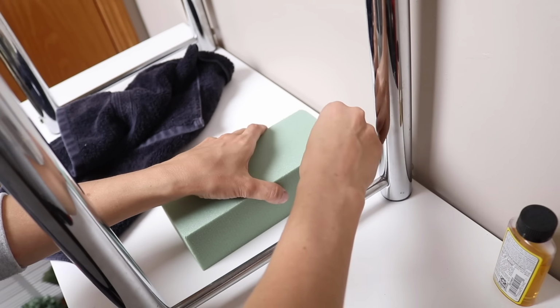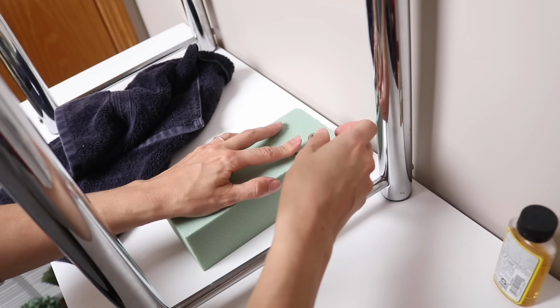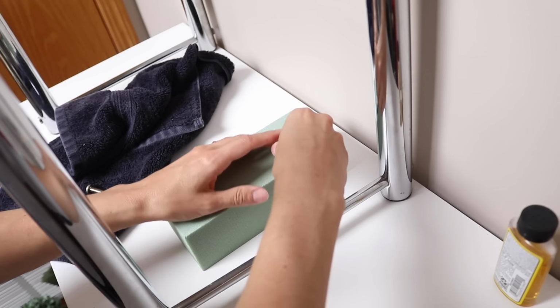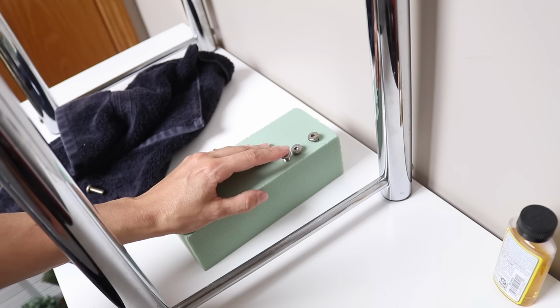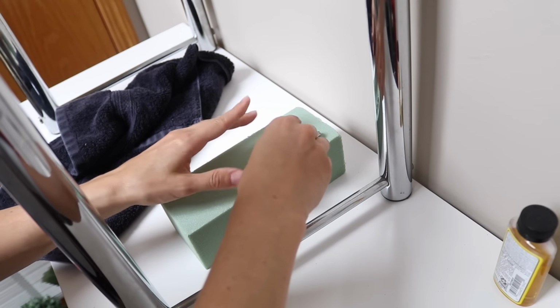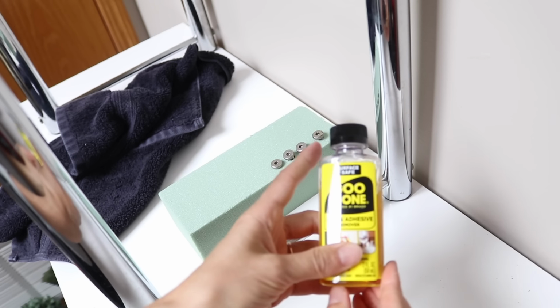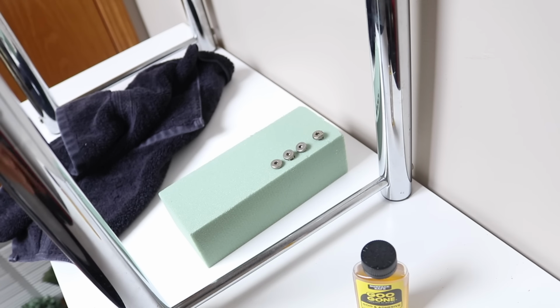And for the screws, if you ever have to spray paint any sort of hardware that's going into something that you're going to have to screw in, I always like to use styrofoam, and I just put those pieces in there so I can get the cleanest finish and you don't have a bunch of drip marks, because it is hard if everything was to be assembled and spray painted. Even if you were super careful, it would develop drip marks.